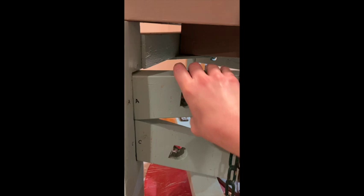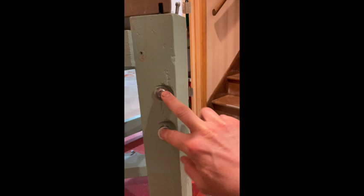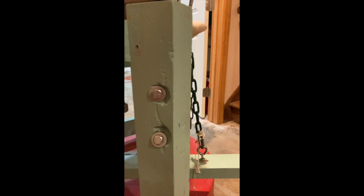This is just pine two-by-fours, construction lumber — nothing fancy. You can tell I didn't really care a whole lot about the holes. I drilled straight through with — I don't know what size — but you figure out you want it not too big; you want some beef in the structure still, but you also want to be able to lock these down. These fancy-looking holes really aren't that fancy; it's the same kind of drill bit called a Forstner bit. You can make little jigs if you want, or you do what I did — just kind of go in straight, then curve it, and keep going.